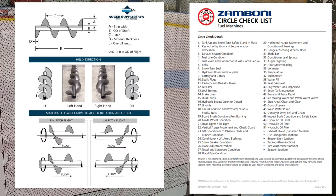Number thirty-three: auger flighting. From what I gather, auger flighting refers to the design of the auger itself — the distance between the fins, the shape, and how they're oriented. The horizontal auger fins are opposed to bring snow inward. Make sure the fins are all in good condition, nothing is bent, and the auger is spinning well. Make sure there are no bends or bows in the auger fins.